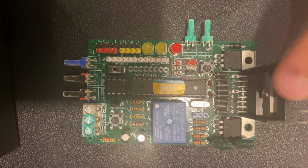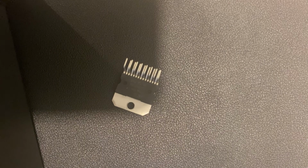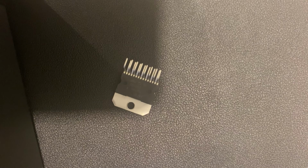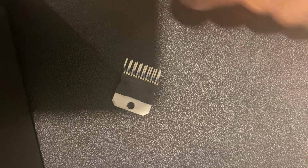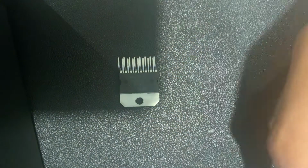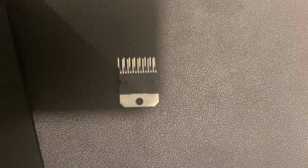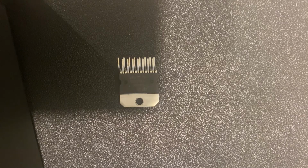So this is the L298 motor driver. This is the L298N motor driver full bridge IC. As you can see here, this is a non-soldered version and it has lots of pins. On here, on the custom PCB, is the version with a passive heatsink with an option for active cooling with a fan. So this is the first iteration of my control electronics to use the L298N full bridge driver to create an H-bridge for cooling and heating.